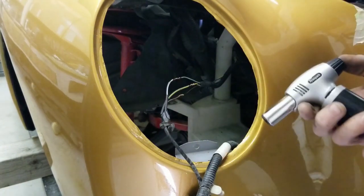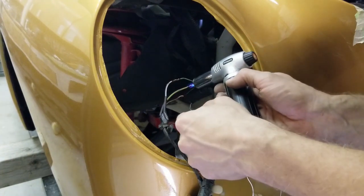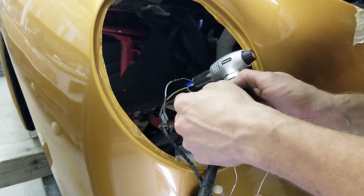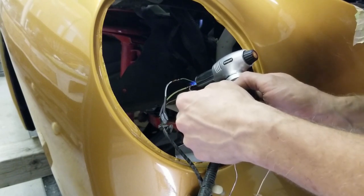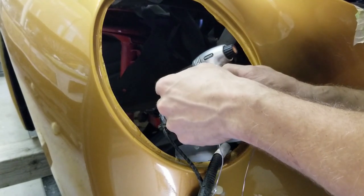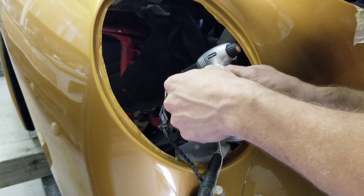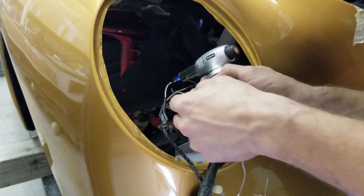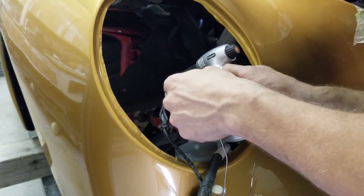Nice little flame there. Now there's a way to lock this thing as well. Heat up your joint — don't overheat it. You don't want to heat the solder either; you want to heat the wire and have the solder melt into the wire. Just going to touch the wire — when the solder starts melting, you know it's hot enough. Just like that. You don't want to overdo it with solder — you don't want gobs on it. Not necessary.